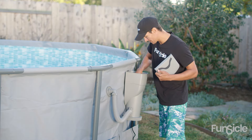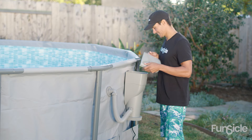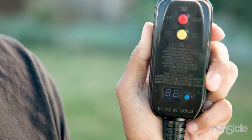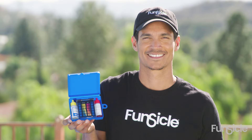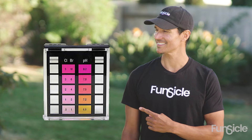If you are using an SFX, you can now insert the rest of the canister parts. This is a GFCI power cord. If you notice that your filter pump is turned off after plugging it in, do not worry — the pump power is controlled by a daily timer that can be configured through the set button. Refer to the user guide for instructions. Lastly, use a pool test strip to ensure the pH and chlorine levels are in a healthy range.